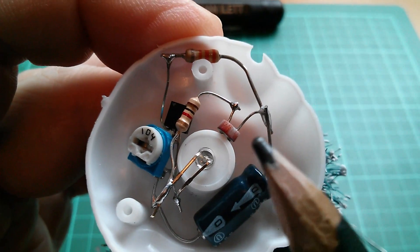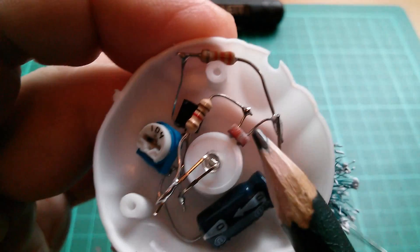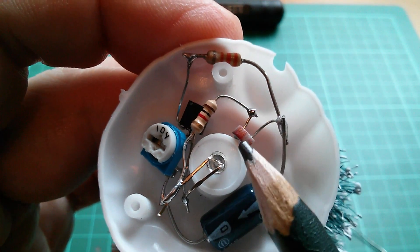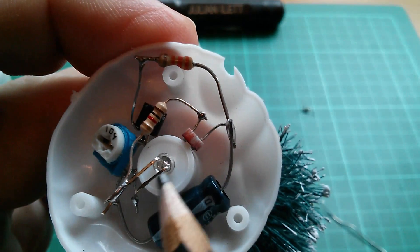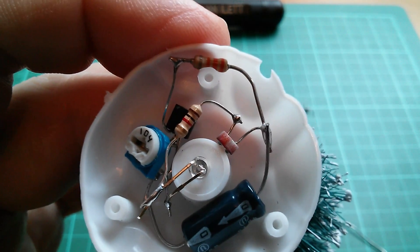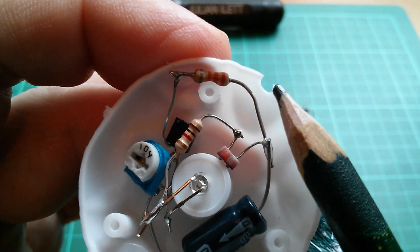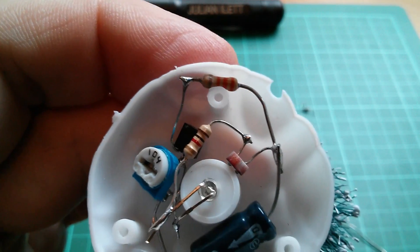The most difficult thing is actually trying to get everything to fit in the base so it's all flush — my transistor is buried quite deep inside now and soldering to it is going to be quite difficult, but I'll persevere. I don't really want the LDR facing up towards the tree, because I don't want it to catch too much ambient light, so I've got it facing directly into the white plastic where the LED is sitting. I hope enough light gets through from the LED to the LDR to make the circuit operate. All I've got to do now is connect the positive and negative battery connections — positive is here, negative is up here.